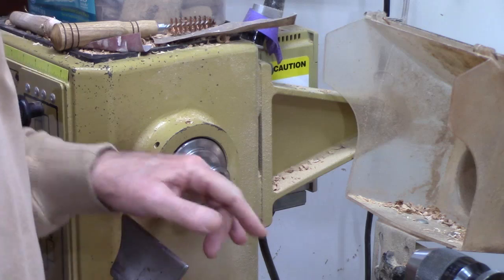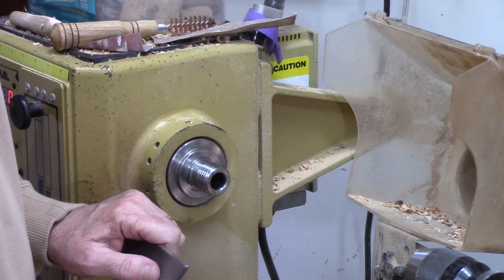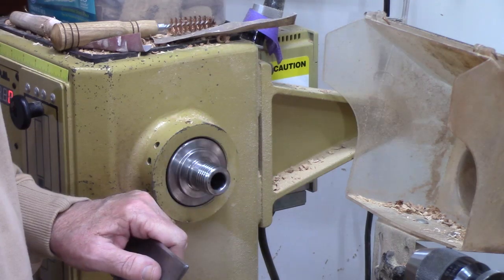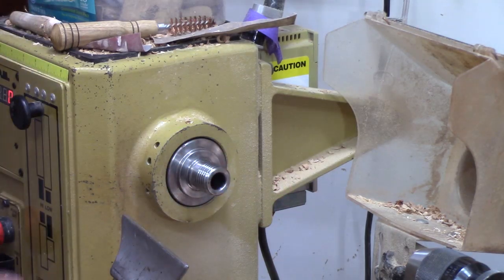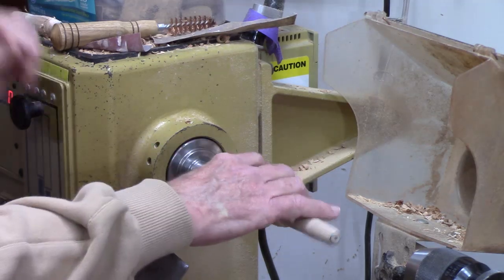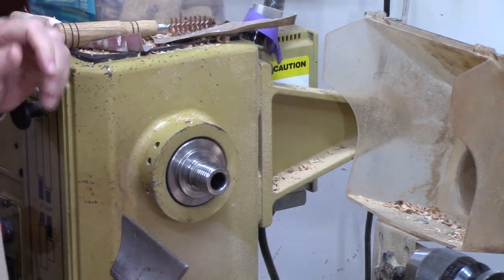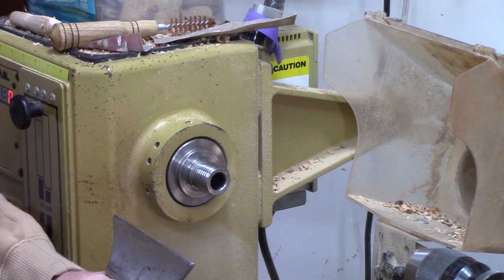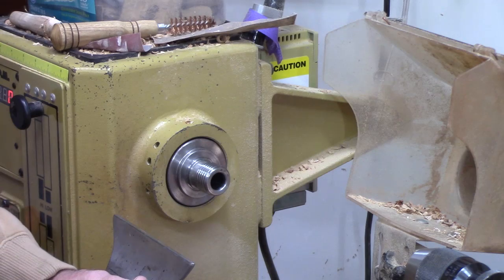On the inside of the spindle, if the damage is in one small spot, you might be able to use a small file — being careful not to damage adjacent areas, you might want to use a round file. Then you could take a Morse taper, put some very fine sandpaper on it, and deal with that spot. If it's only minor damage — this might occur if you buy a used lathe or get a friend's damaged lathe — that's where a reamer could help.